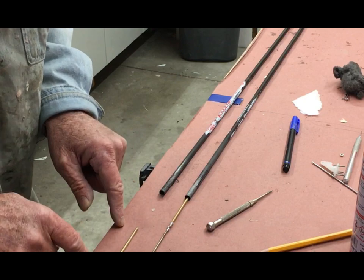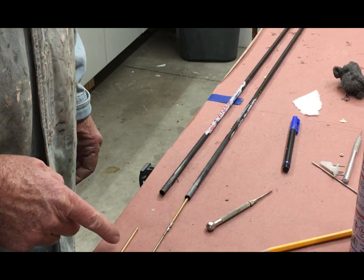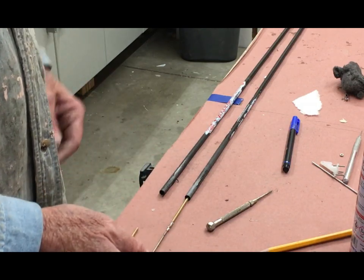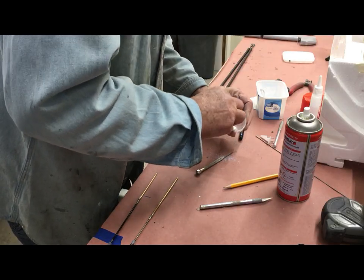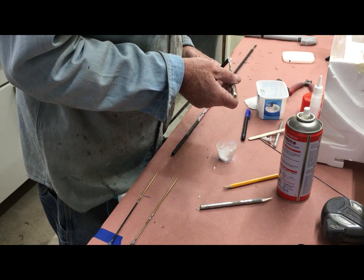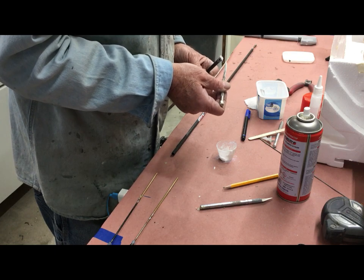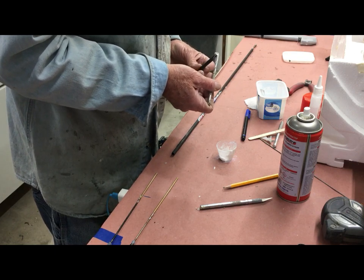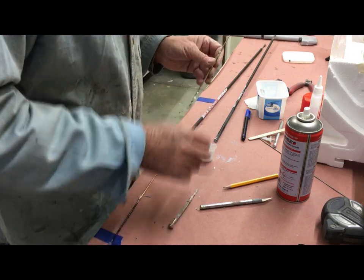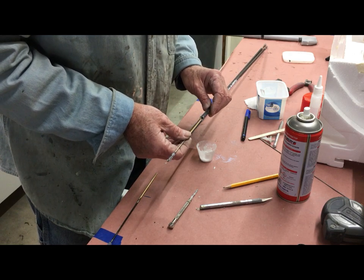I have soldered these so they're good — the push rod goes in deep, actually to the end. I wanted to make sure I got really good depth penetration here and I wanted them stiff, so now I'm mixing some epoxy with some filler, just trying to ram it in there, trying not to push the wadding down. I'll get the tubes in then apply some heat so the resin softens and runs down. Twisting it as we go — good penetration as they say.